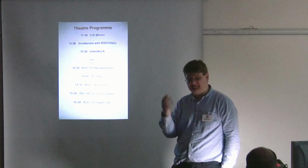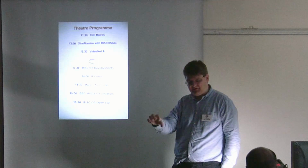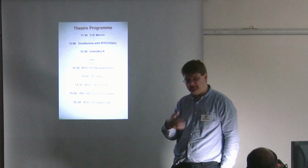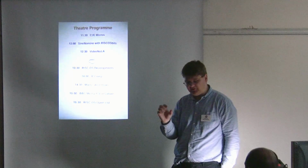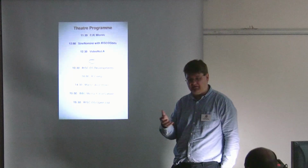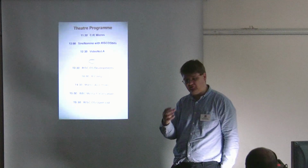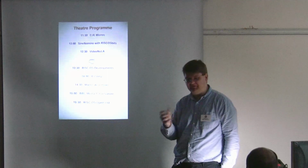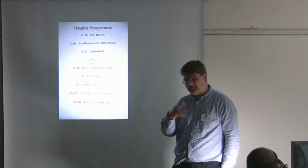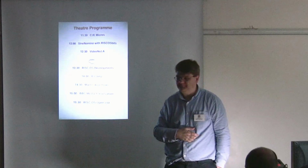One thing I didn't mention is that on the BBC B the ULA is socketed, but on the Master, B+ and Compact, the ones I've got, they're all soldered in. I've been saying to people, if you're ready to cover postage, I'll fit it for you. Anyone who's worried about desoldering their ULA, I've done loads of them now, and I haven't damaged one yet. So I have been fitting them for free. Thanks.